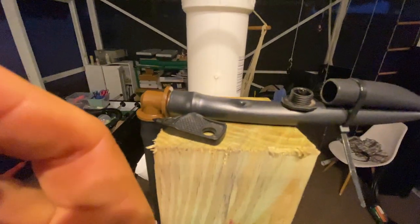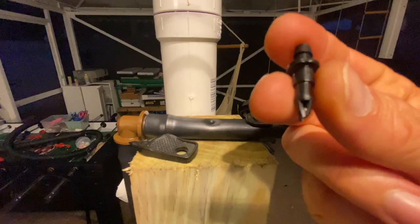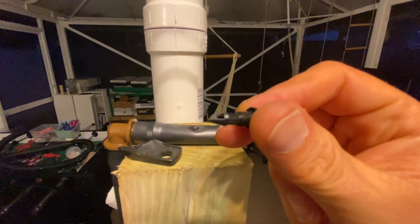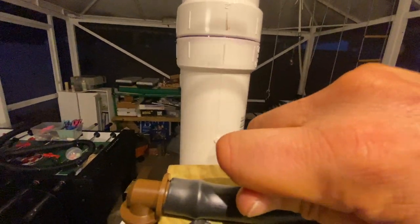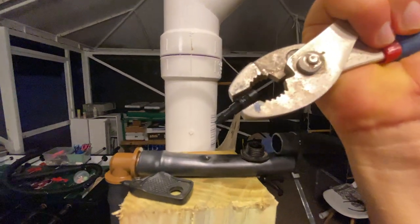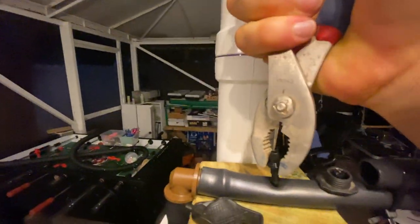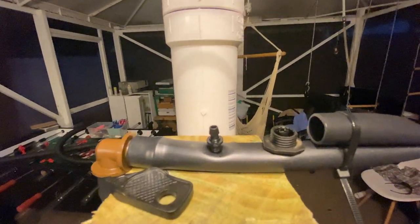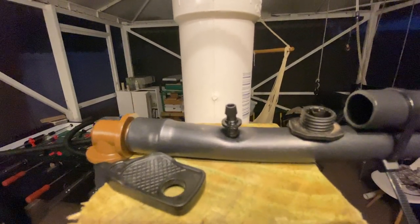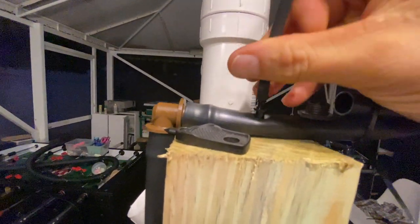It's really simple — you push it down in the middle, it pops in and makes a little hole. Then this is called a barb — it's got a little barb on the bottom where the water goes in, and it's supposed to be self-tapping but don't try doing that, it doesn't work that well. I got a pair of pliers — there's actually a tool you can buy to pop these in but we're just using pliers. Push it in — there we go, pops in. Now we've got that little barb in there.